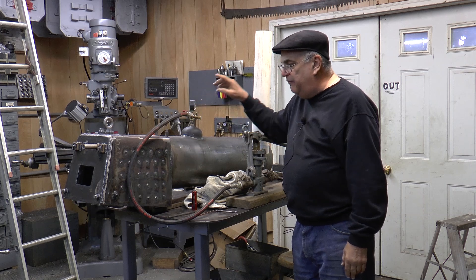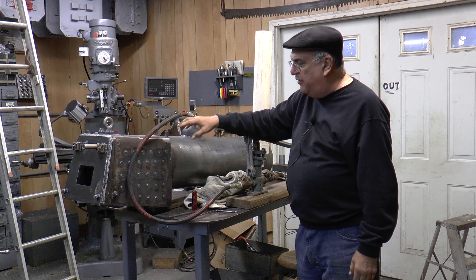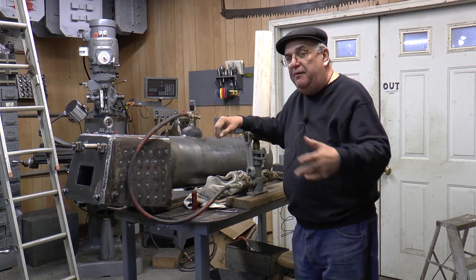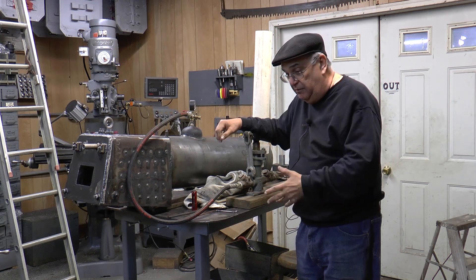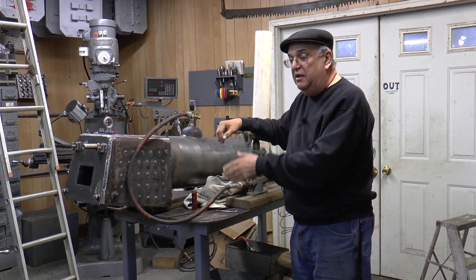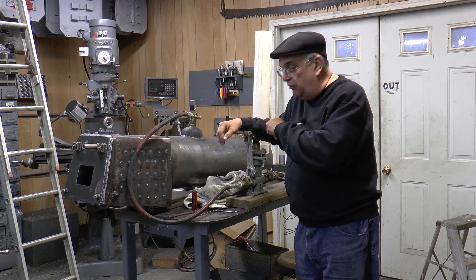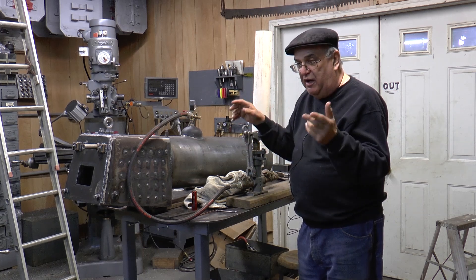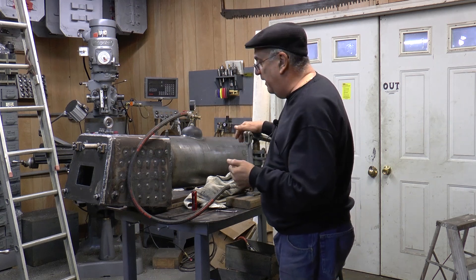When you put it under hydro, it will expand everything and open up a hole — it's possible. You have to find them. You have to dump all the water out, or at least get it down below the weld where you've got to fix it. You grind out the pinhole, and then you go back and fill it in — whether using whatever method you're going to use. I used TIG weld and you fill it in, and that takes care of it.